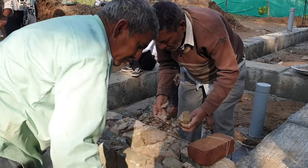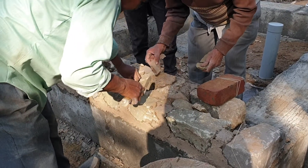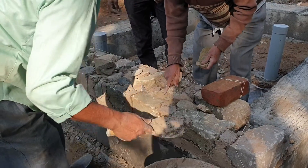The first opportunity for us to use Lime in our construction was as mortar in our stone and brick walls. Just the way we don't use cement on its own, we don't use Lime on its own. Lime only becomes strong or begins achieving strength when it is dispersed and distributed through the inert particles that we call aggregate.